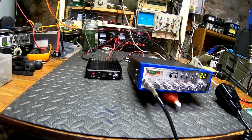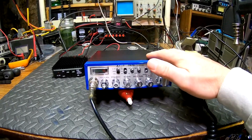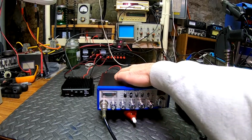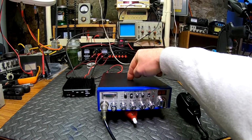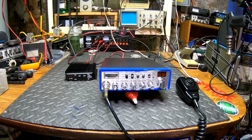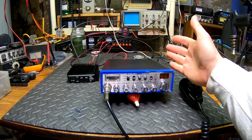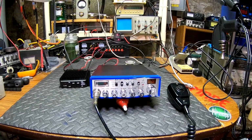It's pretty much impossible to get these perfectly clean with a low carrier and FETs, like I said, but if you wanted this radio to be 100% clean on the waveform, which in my opinion isn't really that important because I'm not a huge purist, you would have to have the 2030 IRF high powered mod reversed, and we would have to put a bipolar transistor back in this radio again. So that would be a whole other job, man, if you want to end up doing that down the road or not. And it would also show slightly less wattage after that's done. But the thing with the FETs is they show a little bit more when they're cold, but then once they get hot, they actually dip down almost to where the bipolar is, if not maybe even lower. So they don't handle heat very well.